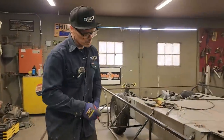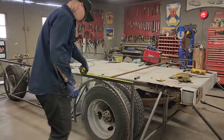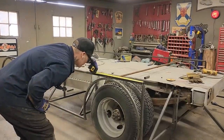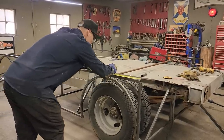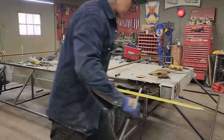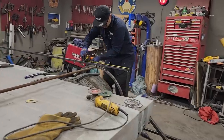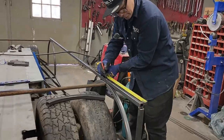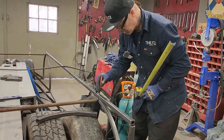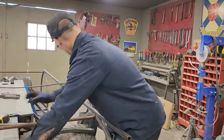So just gonna make a measurement. We're pretty well the same here, we're plumbed up. So I'm just gonna make a measurement here from there to there. I'm gonna mark it at... we're connected right there. Right around the center. I'm gonna say 17.5. I'm just gonna try nailed on top of what's going on there. We'll put it on that side, put an X on that side so we know what side we want it on. Hoping that 17.5 is basically the same. Love it, love it, love it. 17.5. Put a line at 17.5 and then put an X on this side. So the stud's gonna go on this side, and we're gonna put on 17.5. And it sits right on the middle of that, which is where we want it. Let's start the welder up.